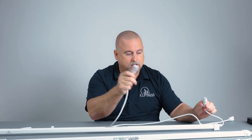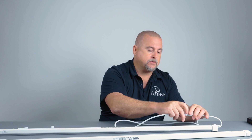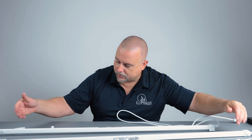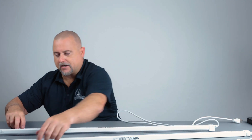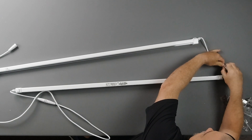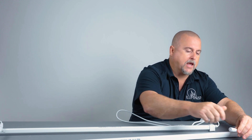Here is your female socket and here is your male socket. You snap it on, then this screw tightens the fit, giving you a nice tight IP67 connection that goes right into the wall. To connect two lights side by side, connect one to the other and cap the open end — you don't want any open cables exposed. All of our LEDs come with end caps, and make sure those end caps are sealed before you start growing, so humidity doesn't compromise those connections and cause short circuits.